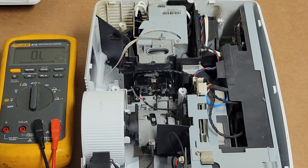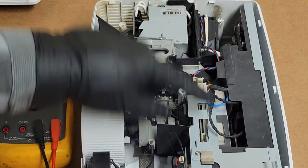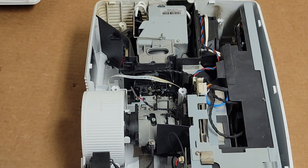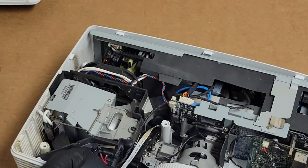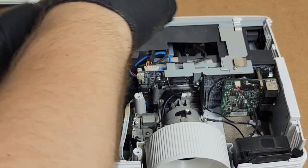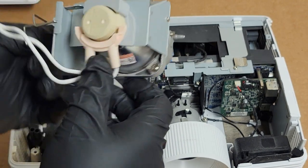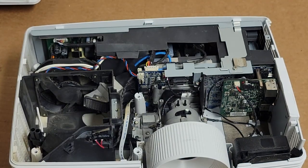So we're going to retape the connector for the color wheel, the keyboard, and this little area here after we fix everything. So we'll get Mr. Meter out of the way. And let's see how to get inside this HD28DSE. So first we'll take the lamp assembly out. This is a good aftermarket one. It's got the Osram 210 E20.9 in it.